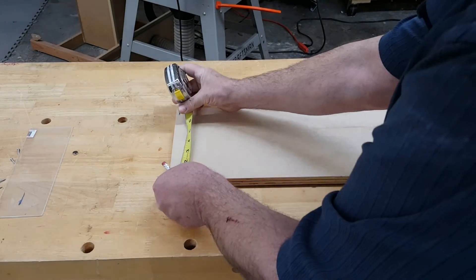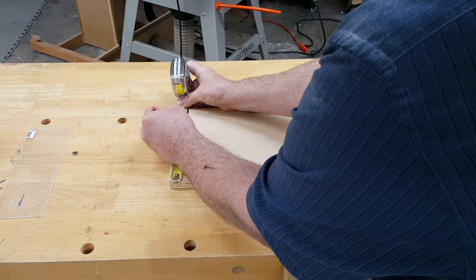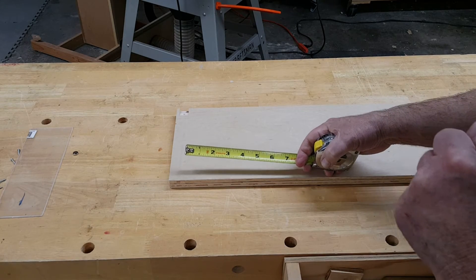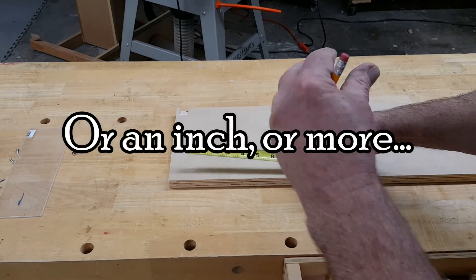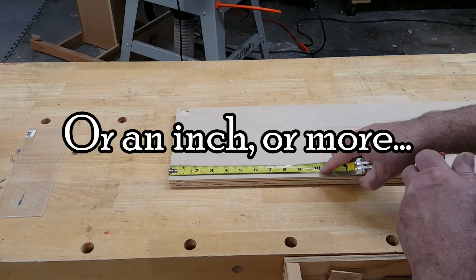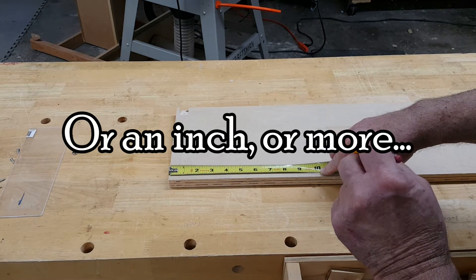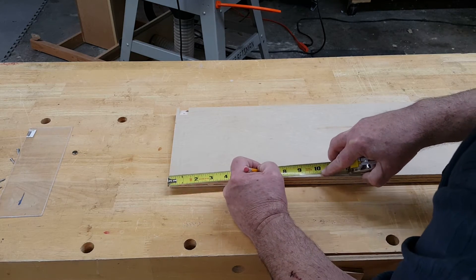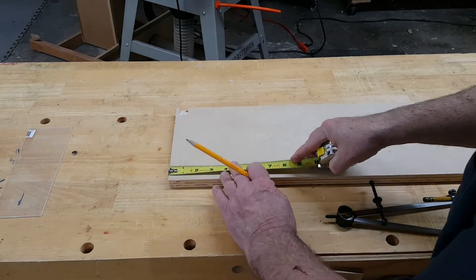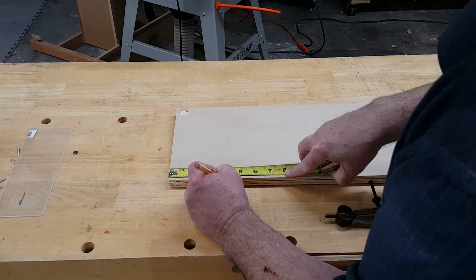The top of our measuring tool needs to be six inches, the same height as the rule. For width, we've got four inches across — let's add another half inch so that we can turn it one way or the other a little bit and not get off the table. So four and a half, and let's make each leg an inch in width. That gives us six and a half for the width of our measuring tool. Half of six and a half is three and a quarter — that's where we'll put the point of the compass for both of our arcs.